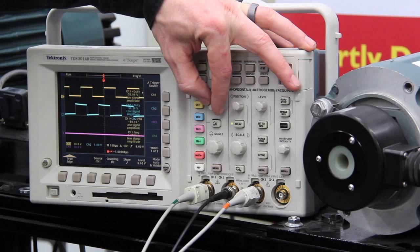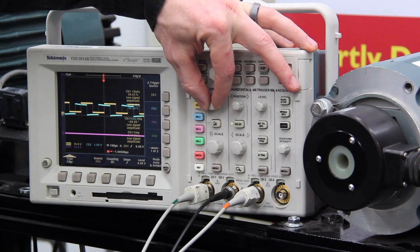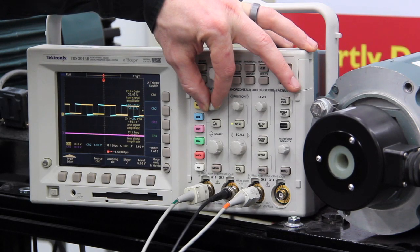You can use the position to give you further indication. When you see that the waveforms bisect each other with 50% of duty cycle on either side, this is an indication that the phase relationship between A and B is also correct.